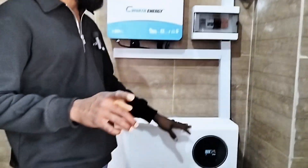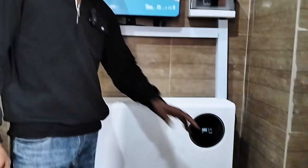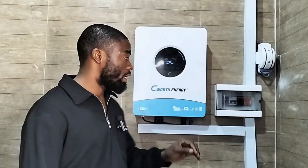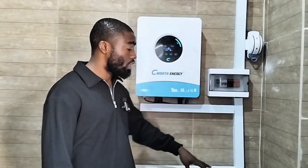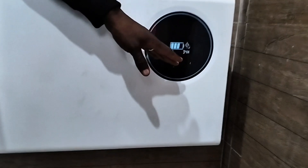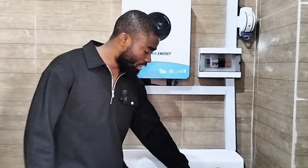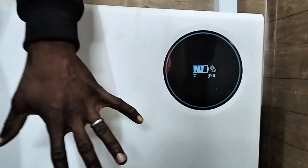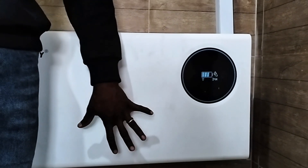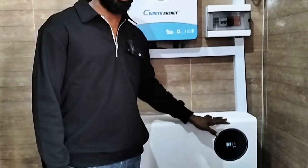There is something I still observed, which is why I decided to do this video. My hunch earlier was not wrong about the number of hours it will take to drain the battery. When the AC was on, the power being drained was 2,600 watts and the battery displayed about 2 hours 20 minutes to drain out. So we decided to turn the AC off. Immediately, the battery is now showing that at 90% DoD it will take 34 hours running at 400 watts.